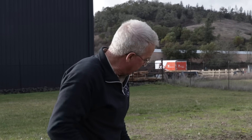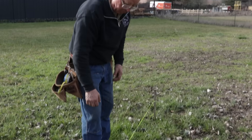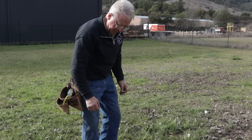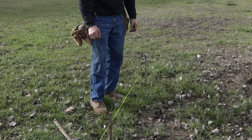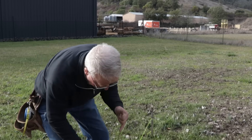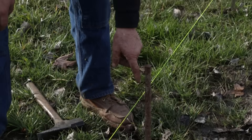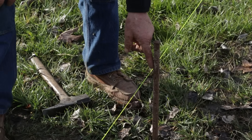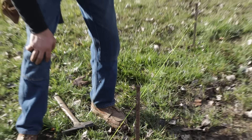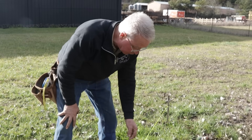So now you can see why the first strings that you run need to be long — they need to be wide so that that line stake doesn't interfere when we're actually bringing it in somewhere close to the building corner. So what I'm going to do right now is pull those strings off the end and tie them to this. At this point, if I had a laser, I could shoot a grade on that, shoot a grade on the other end and have these things to grade and to line. Here's the takeaway: that stake is exactly 36 feet from the other string. I'm going to go down and cut that end loose, tie it onto the correct stake, stretch it to this stake, and we will have our objective of two parallel lines.